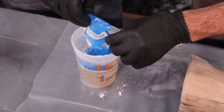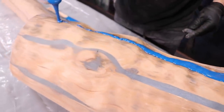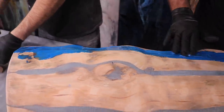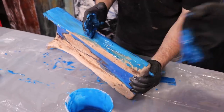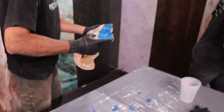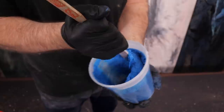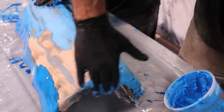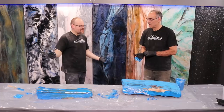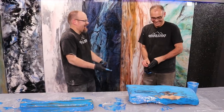After mixing our quick coat at a one-to-one ratio, we'll add our epoxy thickener and some more metallic powder. Just work that in. If I have excess, can I go to another spot? Oh yeah. Should we pin this? Probably should — let's go take that in the shop and pin nail it. Let's make this batch a little thicker — that's a paste. I'm just finding any little micro crack and filling it in. We'll let that dry, come back, sand it all off, and start our clear coats.